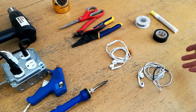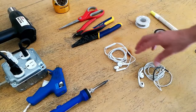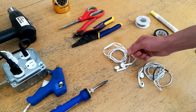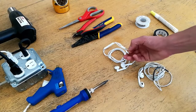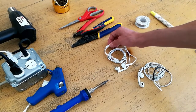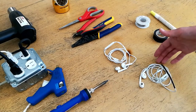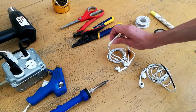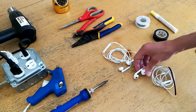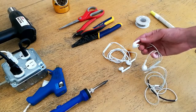Now, before I start this modification, a little bit of theory as to why these are not compatible. The way that the volume control and the start-stop button in any of these headphone controllers works is it sends a predetermined code down the microphone channel of this 4-pin tip ring ring mini stereo 3.5mm jack. Because the different manufacturers use different proprietary audio signals to create that signal pathway, the different devices across manufacturers are not necessarily compatible.